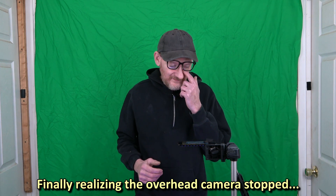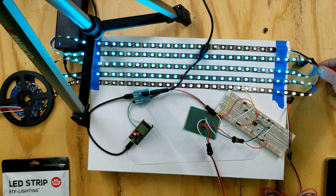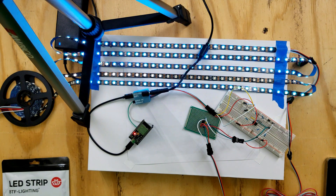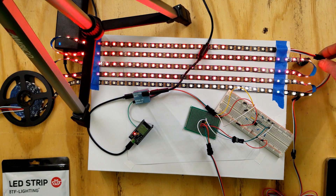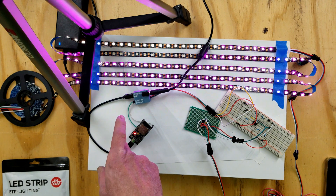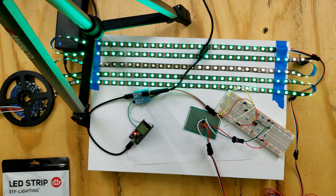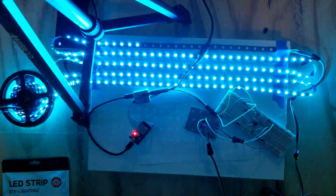I need to restart this — I knew it was going to time out. Now let me show you something interesting: we're going through three level shifters here, with one more inline at the end of the strip. You can put as many level shifters as you need to buffer data throughout your length. If you've got lights going all the way around your house, your power injection points are a good spot to place one of these. The only 3.3V logic is right here coming out of the ESP — everything else is shifted up to 5V. Going into Home Assistant and turning off the filming lights — there's our little rainbow show chasing all the way down the entire strip.